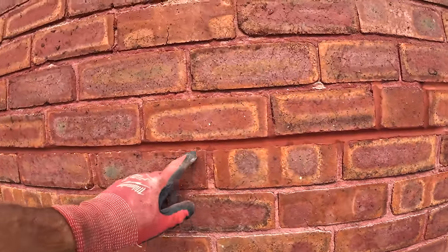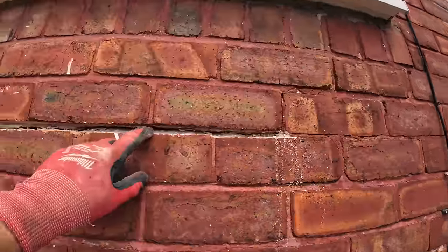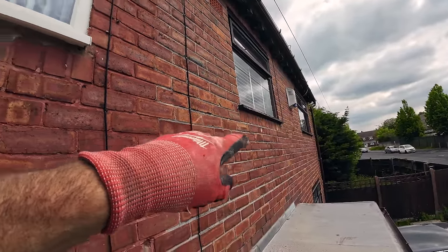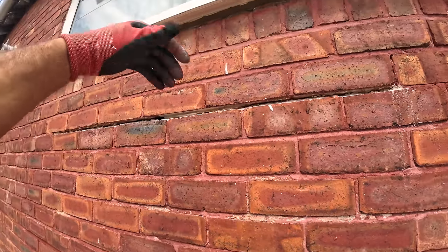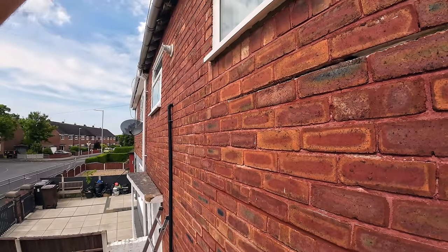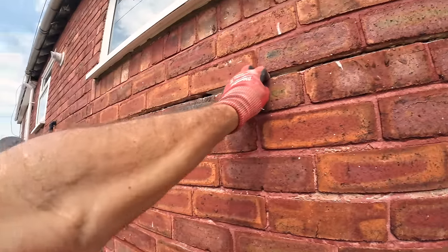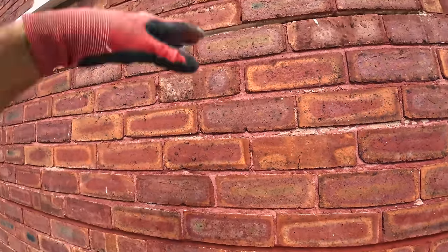And then this is definitely tie wire jacking, as I explained before. If you follow this one along underneath that window, you can see exactly the same is happening, and there's a crack here too, and it's going on the weak spot under the windows because there's not much weight above, whereas between the windows there's more weight of brickwork holding it down. So that explains why it's in patches under the windows. It's the weakest area from there to there in the centre.